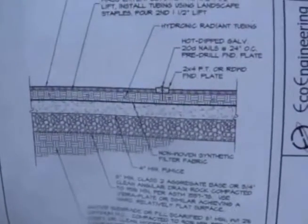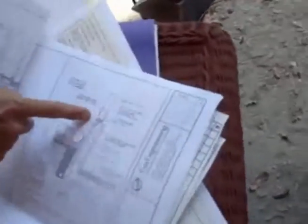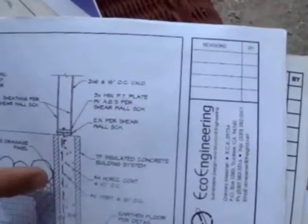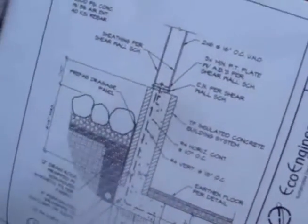So that's basically the plan of the floor — tons and tons of material. It was a big project, took about a year. A lot of people just do cement and put the tubing in the cement, but then you can never really get to it — it's there forever, until you replace the floor. And then at the back of the house is this retaining wall; it's basically the same material but just taller, with lots of rebar in it. And you can see the French drain that we installed.